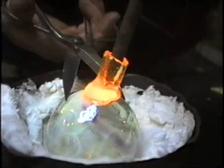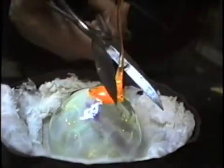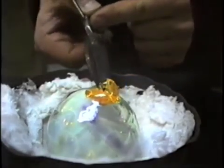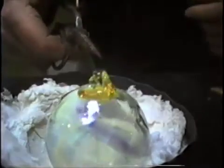I press it down to cover the entire hole, move it over to one side, lift up and cut it off. Then I very carefully take that piece, curl it over and jam it down into the hot glass, and then I lift the entire thing up from the scissor blade and put it in the annealer.